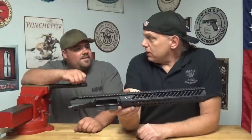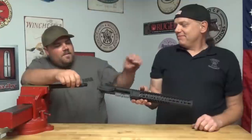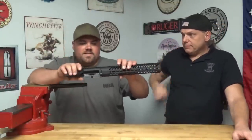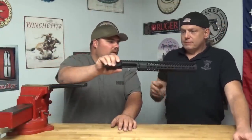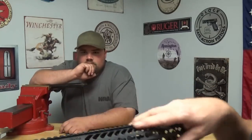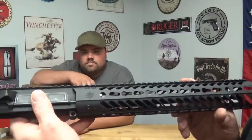So I've got to change the barrel out and work on the hand guard, because this thing is actually bolted on and torqued. This hand guard has a larger section that your hand guard goes on to. If you wanted to buy this hand guard for a standard upper, your barrel becomes much larger. But this upper receiver is actually specific to this hand guard.